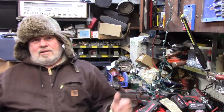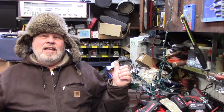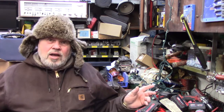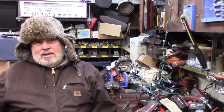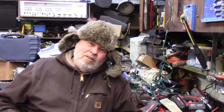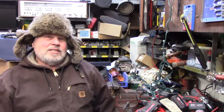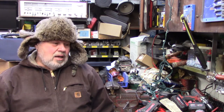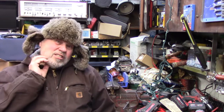One instance where I always use a three-way switch: on either side of the bed. When you come into the bedroom you have a switch that turns on either the ceiling light or the night lamps. Then beside each side of the bed you have a three-way switch to turn it off. That way you don't have to walk back across the dark room and hit your toes on the bed frame — you have the convenience right there.